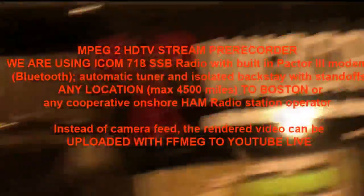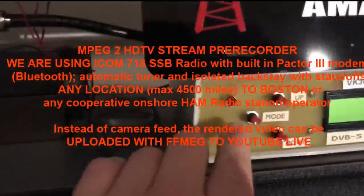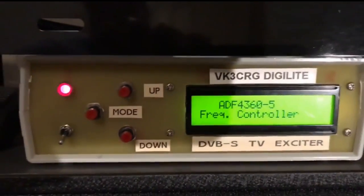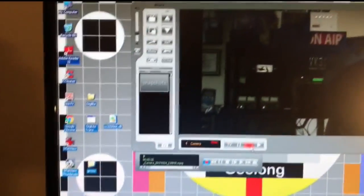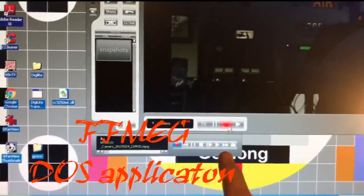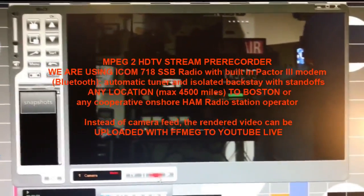What we do now is we turn on the power amp — that's the power amplifier there. We turn on the Digi-Lite, which is this unit here. The Digi-Lite, as the sign says, is a DVB-S exciter. So what happens is we're recording the vision from the camera straight onto the hard drive. I'm going to open a little DOS application in a second. What that will do is as soon as that vision is recorded, it will spit it out as MPEG-2, because that's what the computer is doing — that video card is actually converting that video into MPEG-2, which is what normal DVB-T television has, not the new HD MPEG-4, but MPEG-2.